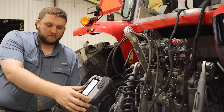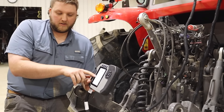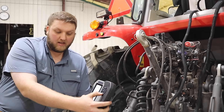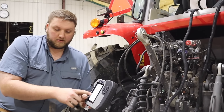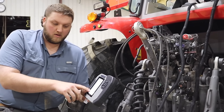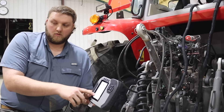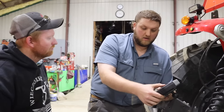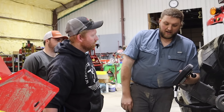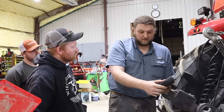Fan auto reverse — all these are changeable. That's the auto lube: every 50 bales it'll run for 10 seconds. There's another service screen to reset. And your last one is your max density pressure — so it won't go over that. The next screen is just settings for the display: brightness, English, sound. The beeps aren't super loud, but we wish they were.